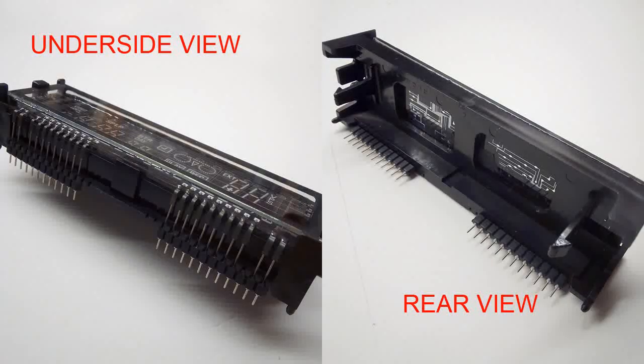For displays like this one, which we've recovered from a piece of equipment, one's unlikely to be able to find the data sheets giving the pinouts, etc. It's therefore fortunate that the details are usually quite easy to find simply by looking at the display itself. In order to display many digits in a single package such as this, the thing will have to be multiplexed. This is where all the anodes are connected together, and each digit is selected by activating the appropriate grid. By scanning this quickly, it will be possible to show all the digits at once.